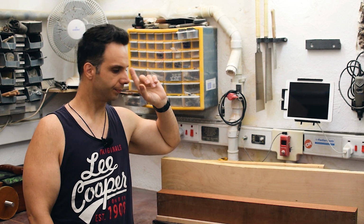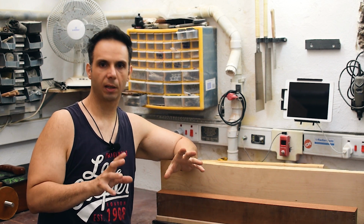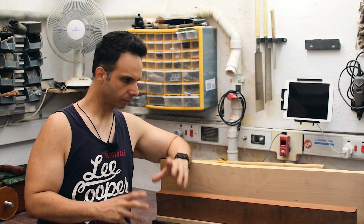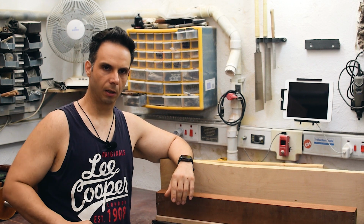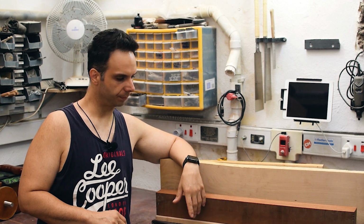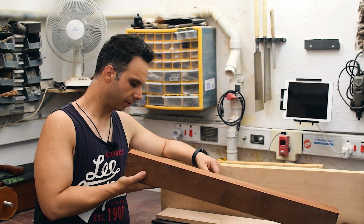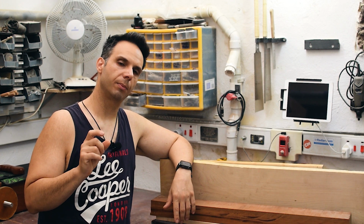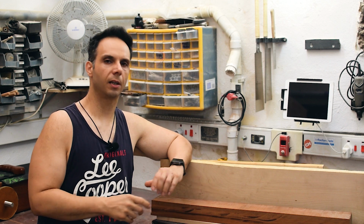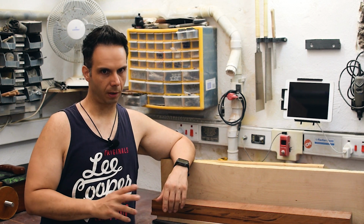So the idea would be, I will make with all this wood a big chunk of 5-piece laminated blank, a thick chunk, and from that chunk I'm going to cut three blanks. Now hopefully I will have enough thickness, because for the Odin model, I like to keep the neck blank a bit thicker than 20 mil, in order to accommodate that little lip that goes underneath the pickup.